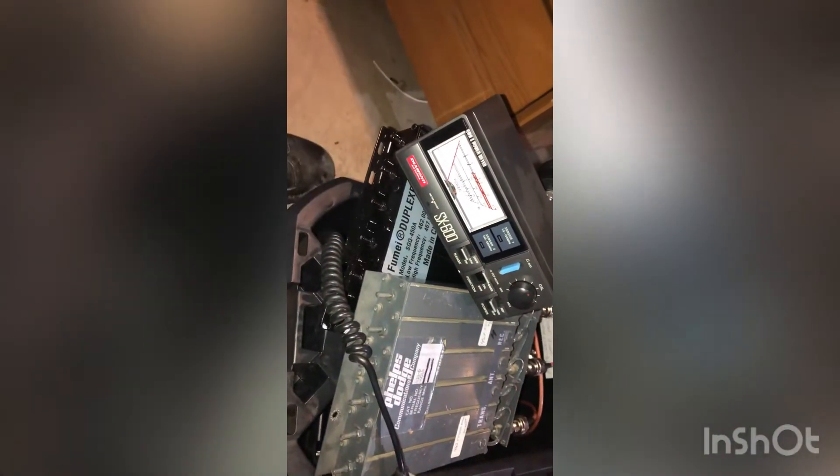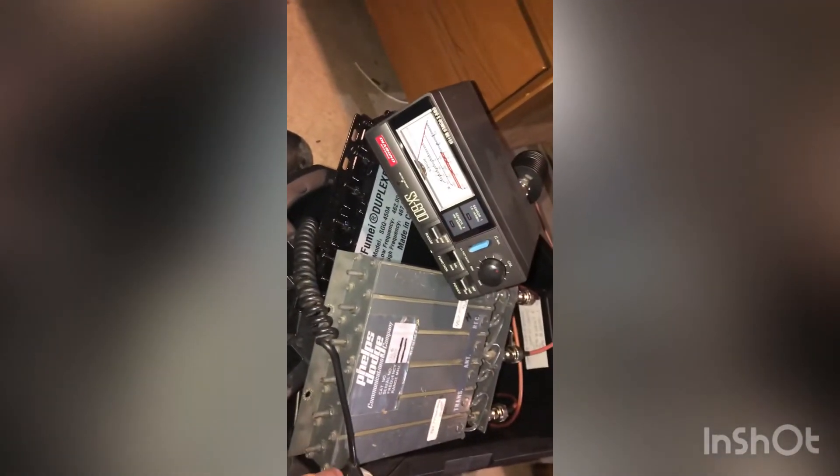So who won the battle? The Chinese won. That's why I've bought several of these duplexers. Every one I've ever tuned for GMRS comes right in at 1.2 dB loss. And they're good for the price — 130 bucks new, I got this one for about 90 off eBay. You've seen the separation on that unit — very impressive.